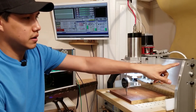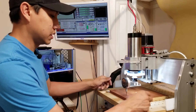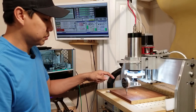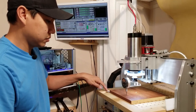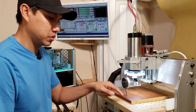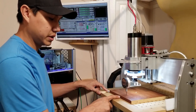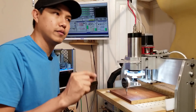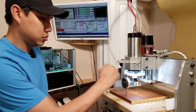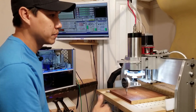One of the issues I had was that my X-axis gantry had a slight bend towards the back. When I put the spindle touching a straight edge on one corner and moved it to the other side, it would only touch the two end points, but right in the middle there was about 1/16" or a little more gap — so it was going in a slight curve back and forward.